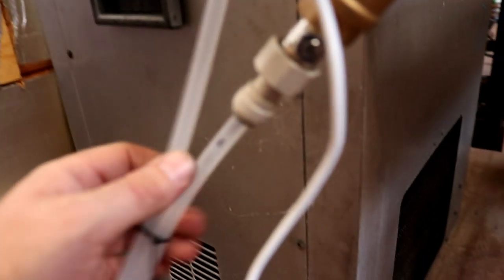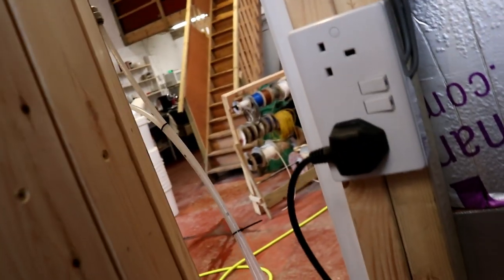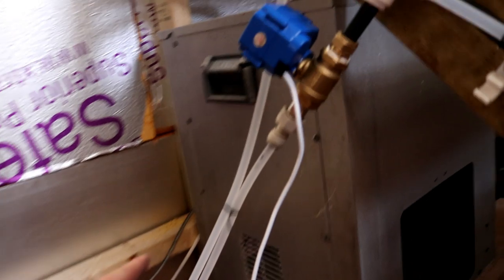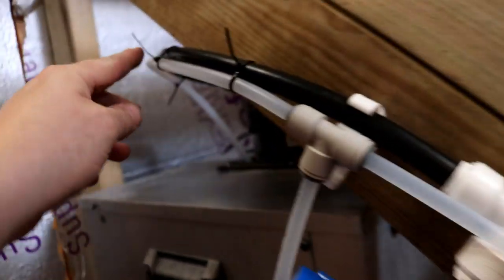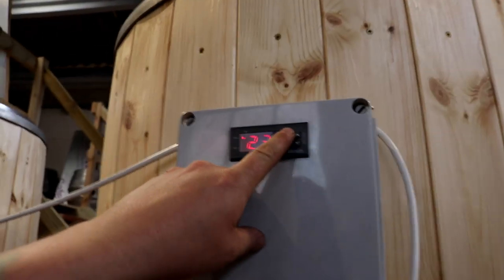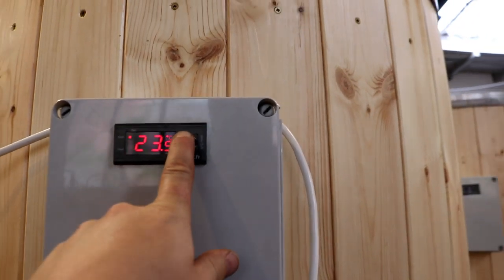The glycol is translated down into beer line and across into the tank. It's going in at the bottom of the tank, pushing all the air bubbles out at the top. This particular one is looping through the chiller plate on the cone as well, because that one has one. Those lines are teeing back together and diving back into the top of the chiller unit. We don't need to have the recirculation pump on - the only reason I had these on was to test for leaks, and there was a leak, but we soon remedied that.